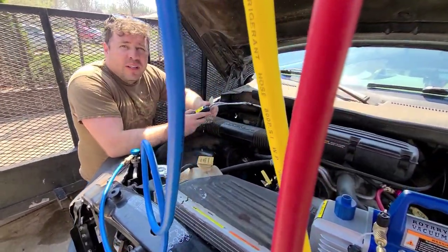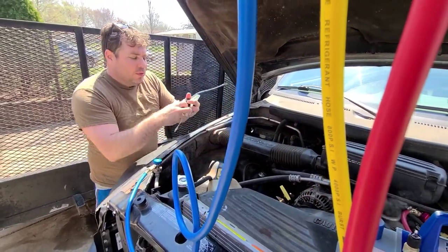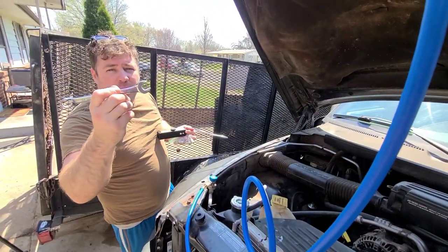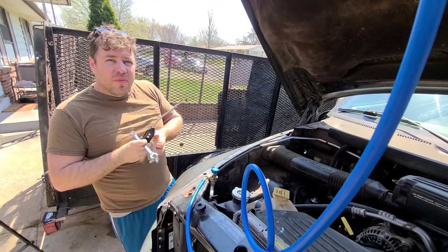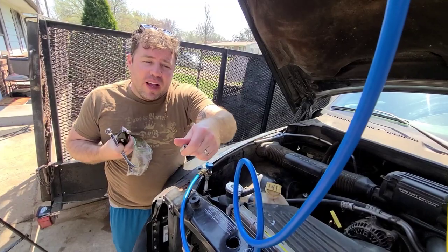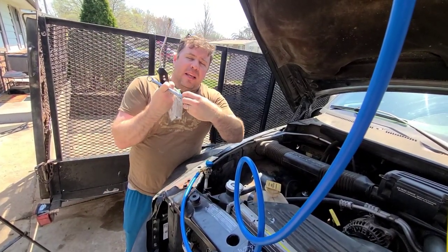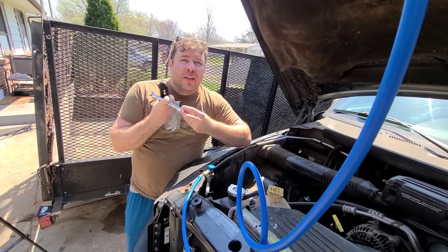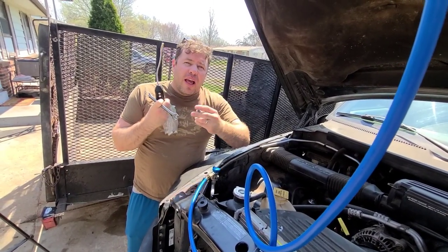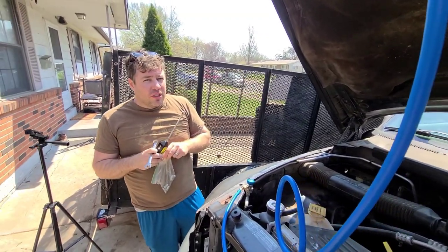So I had this on as part of that video, but also, hey, I did this repair. Oh, if you're replacing these valves, it's a 15 millimeter. You're probably not replacing these, but you could. I mean, they go bad, just like a Schrader valve, but these aren't replaceable. You cannot get them online anywhere. They will say low port, but when you look, they are not the low port. They are always the high. It might be a dealer-only part, which is nuts.